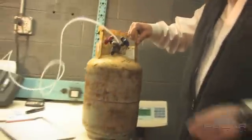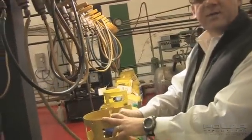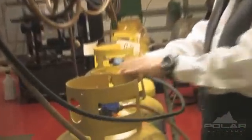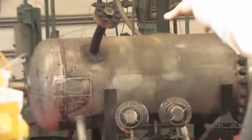Let's get the cylinder over to the other side and take a look inside to see exactly what we have. This is the consolidation and pump down line. This is where we remove all the liquid, all the vapor, and all of the impurities. The cylinders get hooked up, material transfers through here through these large overhead lines, dumps into the distillation vessel, and all the impurities are pulled out over there.